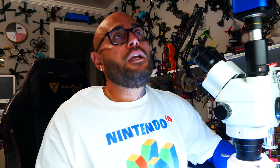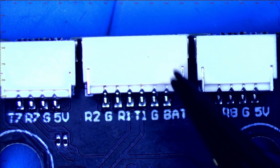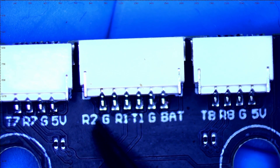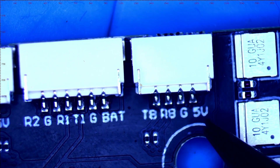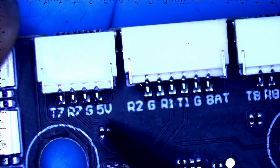You've got three connectors on this side of the board and no other connectors. You've got your USB Type-C and then three connectors: this one right here is your main HD plug, which fits pretty much everything. Then you've got a plug here and a plug here — they are just a typical UART, ground and 5 volt; UART, ground and 5 volt.